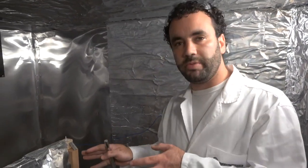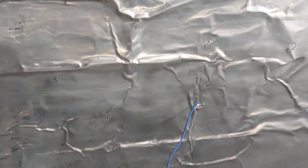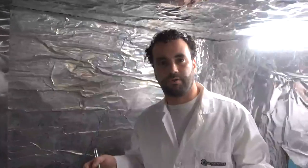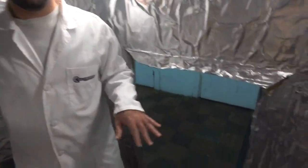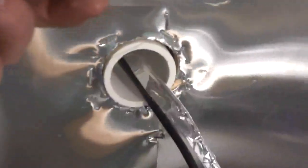We have finally eliminated the noise problem with several different grounding wires that are going into both the walls and the floor. This floor is connected to an eight-foot rod that's in the center of the room, and there are wires that spread out and connect to everything. For the outer shield, it goes to a separate grounding rod that's only four feet, so there are two separate grounding rods all the way in the ground, creating a perfect Faraday cage. If we close the door over here, we will lose all Wi-Fi signaling and cell communications — everything. Even the USB cable is coated all the way up straight through the wall and covered with a plate and coated through the channel, so we really do try to shield out any possible noise contributions as a result of the microwaves bouncing around inside this chamber.